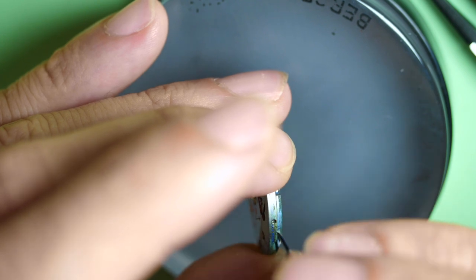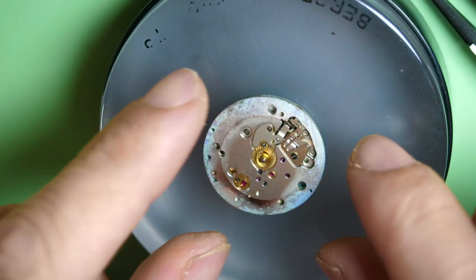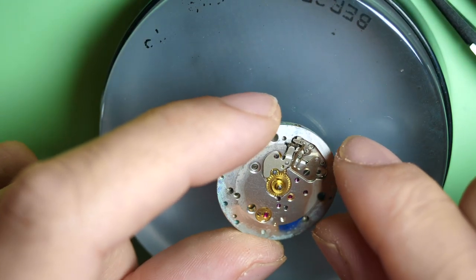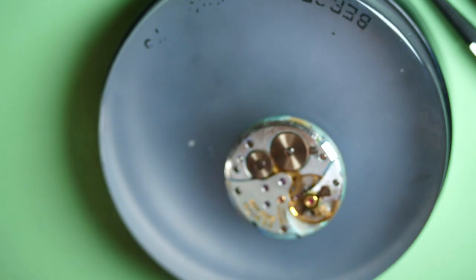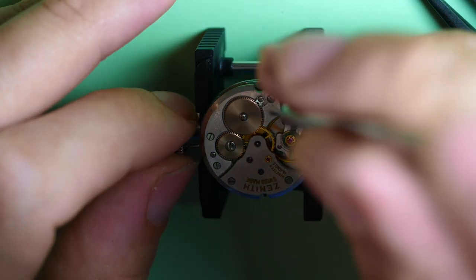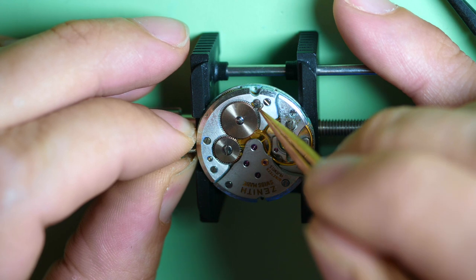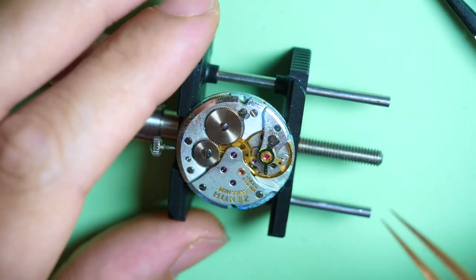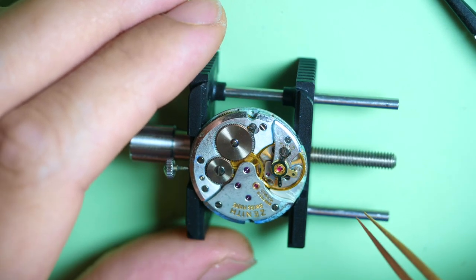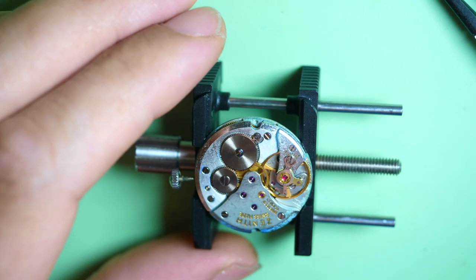It's still running — not running well, but still running, which is quite amazing. I put the screws back just to make sure they stay in place and I don't lose them during disassembly or washing. Looking at this movement, I'm amazed — it looks very good but so dirty. Let's put the movement in a movement holder and release the power by holding the click spring and gently releasing while holding the crown. There we go — power is out and the balance wheel should stop. It's coming nicely to a stop. Now let's remove the balance assembly.